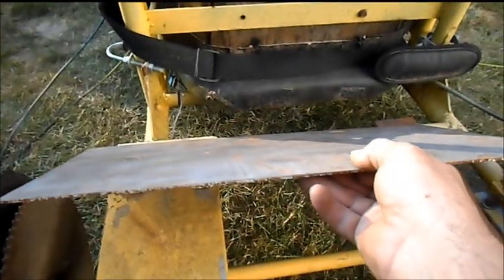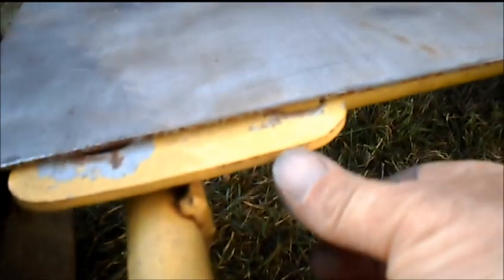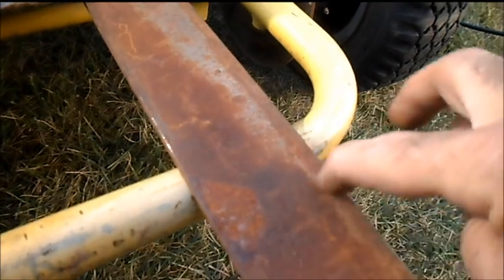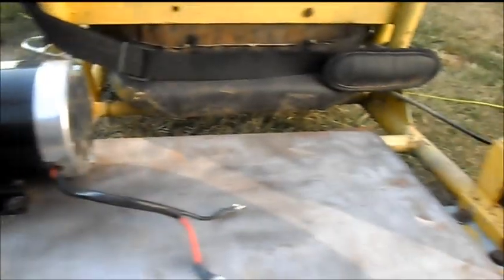I think an easy way to accomplish this would just be a plate of steel and maybe a bridge across here to help support it. We've got our piece of plate steel — it's about an eighth inch thick. And we've got our bridge, which the motor mount was about 3/16ths thick, so I'll grab a piece of 3/16ths for our bridge. It's best to put it right to the very edge and have it overhang just a bit, and we'll cut it off and overhang here a bit as well. Our motor will be mounted right up to the front edge of the motor plate. That should work nicely, and there's plenty of room for the speed controller and batteries, and a good firm surface.